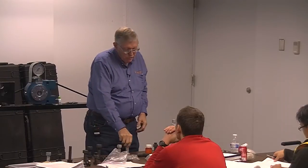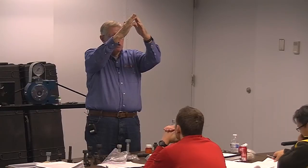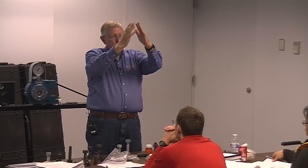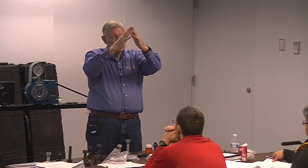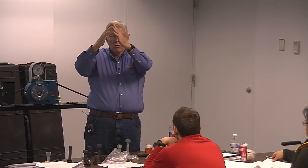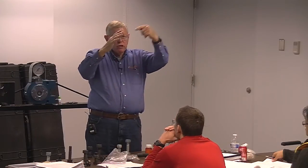But if we've got a connection that's like this, in a skew, and you've got bolts going through here or here, can you get a bolt in that's in this connection? Here's the connection plate, let's say on a diaphragm or whatever situation you've got. Can you get a bolt 3 inches long stuck in back here at the point of the connection? No, you can't. So you've got to go in this way or this way. Here's the nut and the bolt's out here, and you turn the head of the bolt.